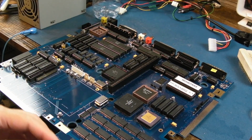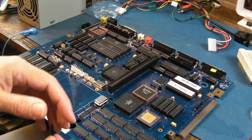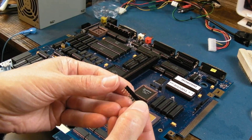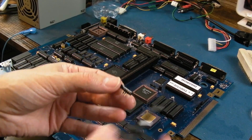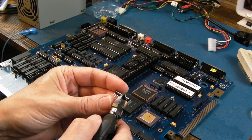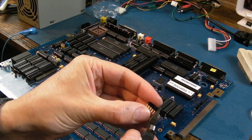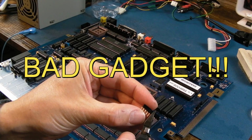I've exhausted all options. So there were 2 resistor arrays I'm still waiting for. One here, and I've just trimmed that one down. I need another 4K7. It needs to be 5 pin, not this big. And I've got a load of these. I'm just getting impatient and want to expedite the testing here. So I'm going to cut almost in the middle of the pin that I want to trim off. That's the key here.